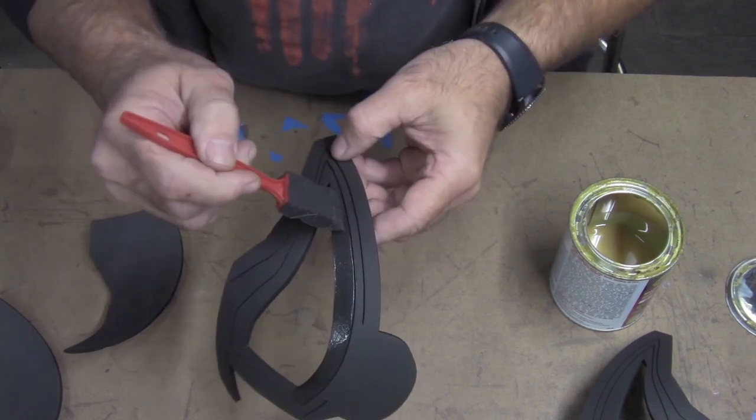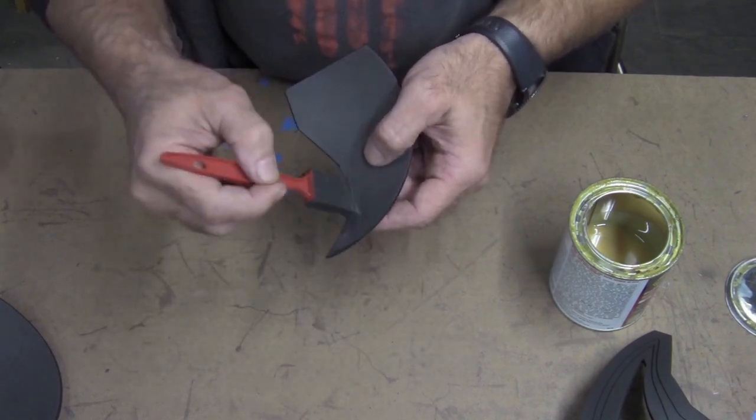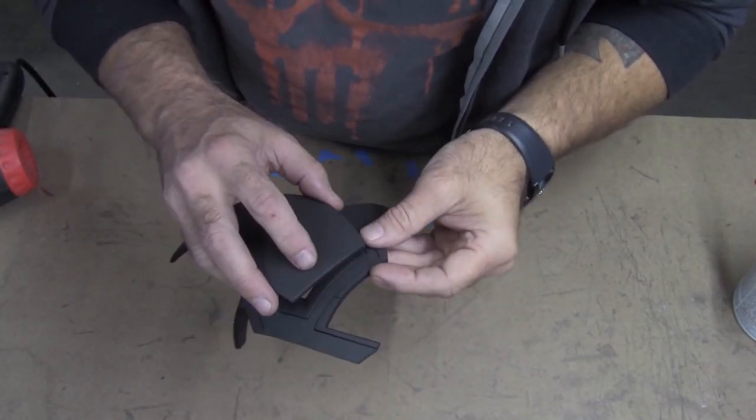Apply your glue to the rib section on the top surface area along the inside reference line and on the bottom surface area of the side piece along the edge all the way around. Then allow the glue to set up. This is usually around 5 minutes.